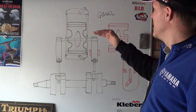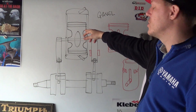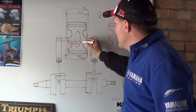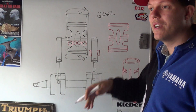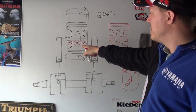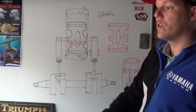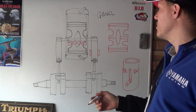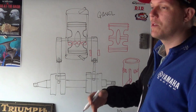What happens is when the piston goes to top dead centre, that uncovers the transfer ports from the supercharger below the piston. So in this drawing your ports would be here. Air from the supercharger that it's drawing through would then go under the bottom of the piston and straight out the exhaust ports. You get good flow - you go through the cylinder and back out, through the cylinder, cool the piston and then go out the exhaust port. It would also help evacuate exhaust gases and lower the pressure of the exhaust system, which would help with scavenging.